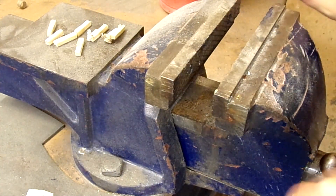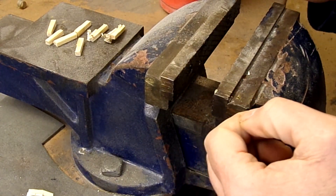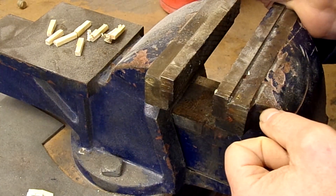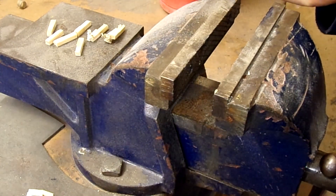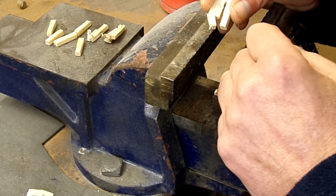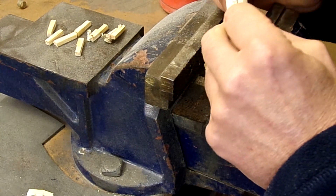There are all sorts of other tests that would be carried out — in my past we would have carried out tensile and torsional strength tests on various components using a scientific format with strain gauges. But here we're just using the standard three-leg system, which is the approved method for testing the shear strength of glue for a batch.